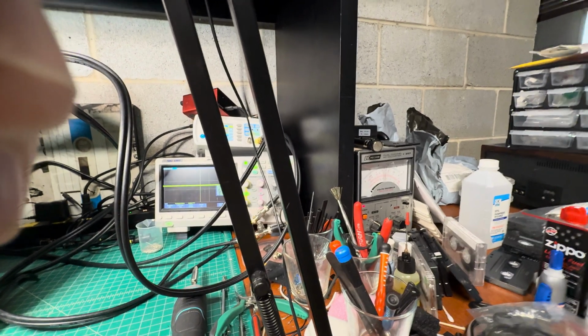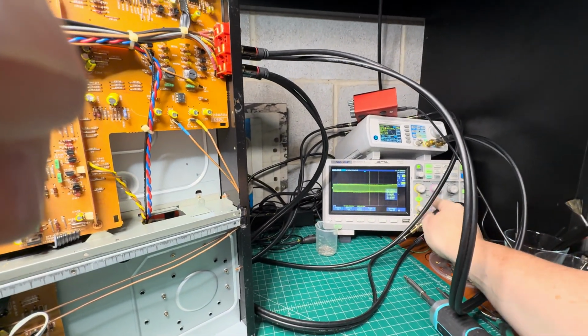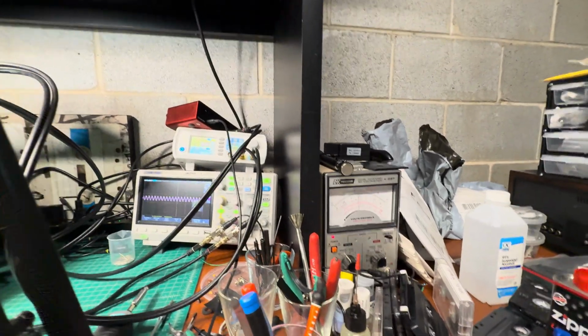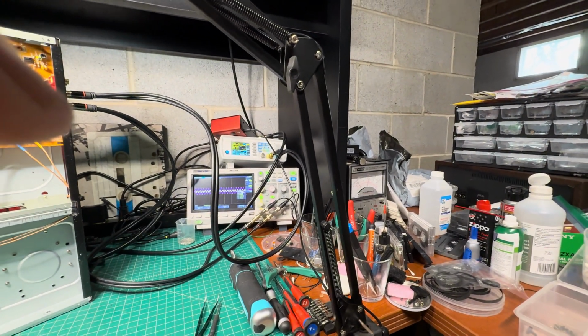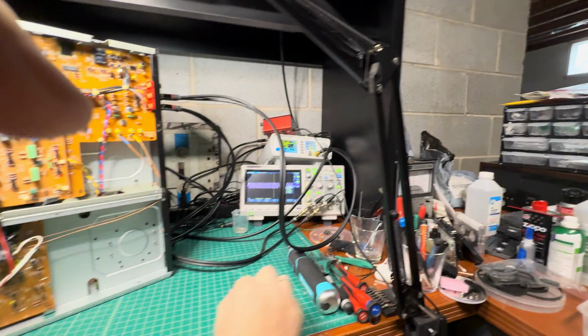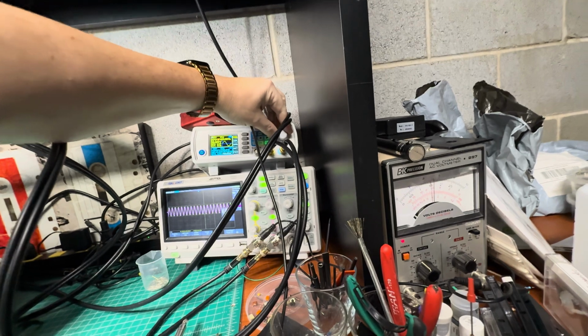Now let me connect the oscilloscope so we would be able to see the signal that's recorded. All right, so without HX Pro, now it's different. Now we need to adjust without HX Pro. I don't remember, this Akai may start with HX Pro. Now with HX Pro, without HX Pro. It looks the same levels, same levels here. Good. Now we can check the response.